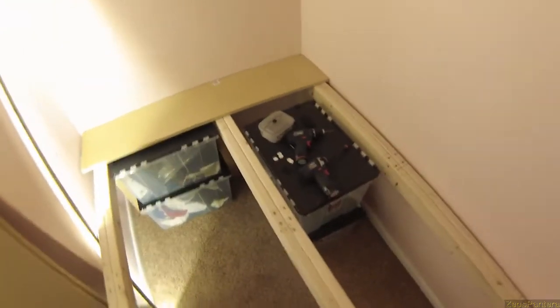All the wood. Now, I put little felt pads on this so that should the bed move, it doesn't start banging into the walls, because it is rather tall. There's a little bit of space, that's fine. I'm gonna push it towards that wall. Get everything here centered up. I gotta get my square out, make sure I'm coming straight off, which I don't think I am with this. Make sure my legs are straight. And then I'm going to pilot hole.